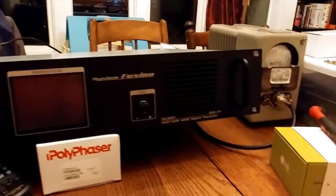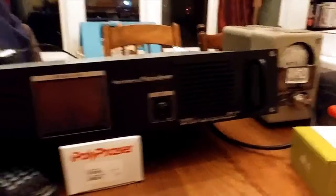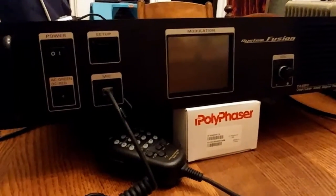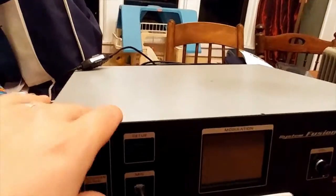So I have my repeater set up here with the box angled so you can see the display. I always use a dummy load power meter when something could transmit. I already have the screws removed from the top, as it will tell you to do in the manual, and I have the cable connected to my computer.